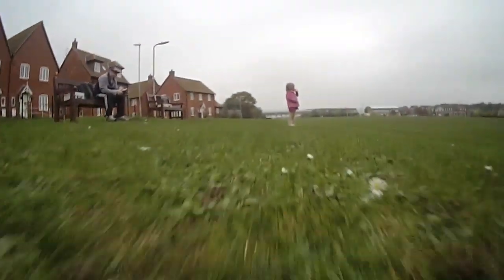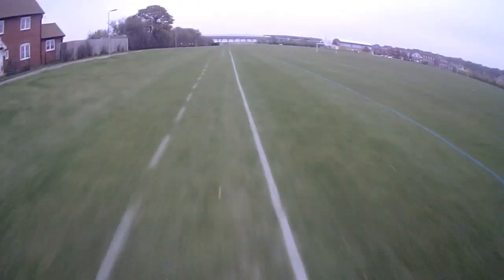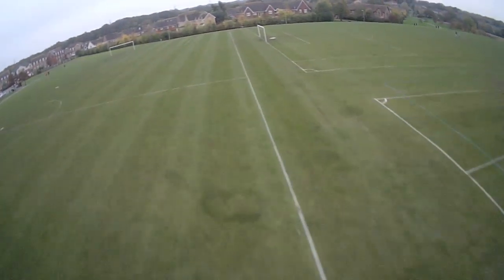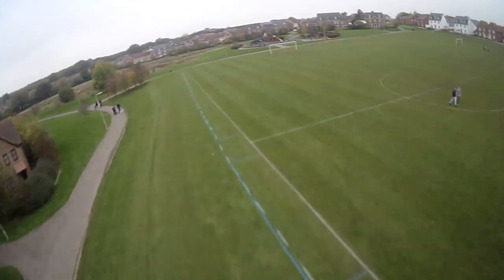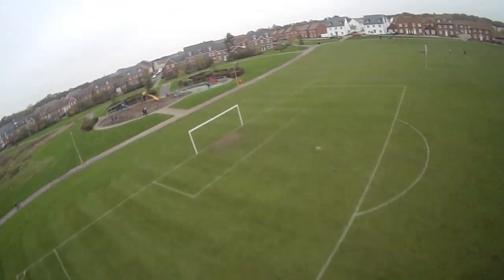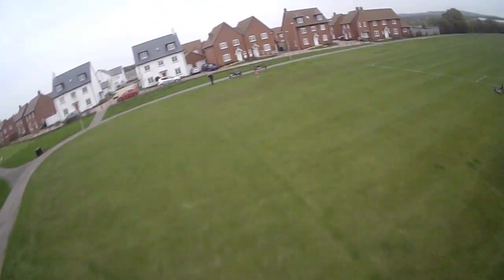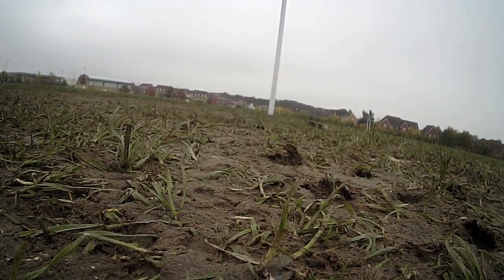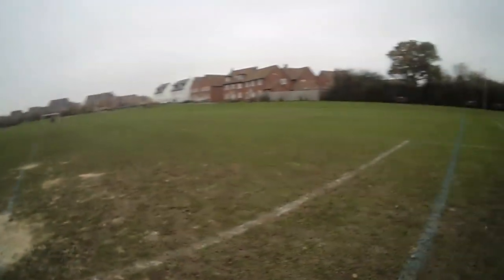Here's the same takeoff from FPV - this is about the second takeoff. It looks pretty good; it's an 808 so it doesn't handle light very well, but the speed and handling seem fine. The only thing I was picking up is a bit of wobble from the motors - I don't think it's camera vibration, I think the motors are having a bit of a squabble holding attitude, so I need to retune. During the flight I had a battery disconnect from my Fat Sharks, so I put it into auto-stabilize and let it come down. It landed with a little bounce but looked structurally fine, and on the next takeoff it was absolutely unscathed.